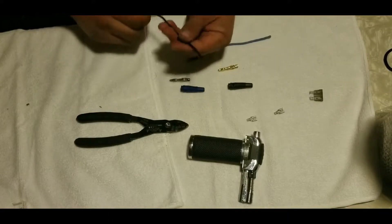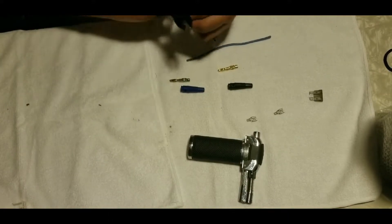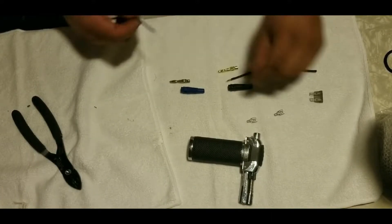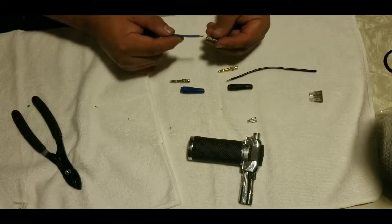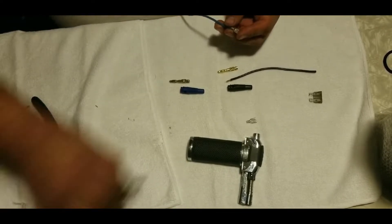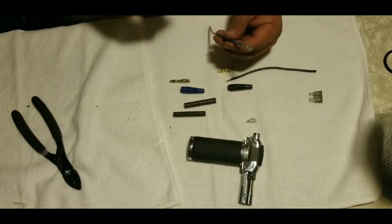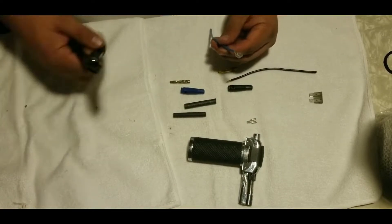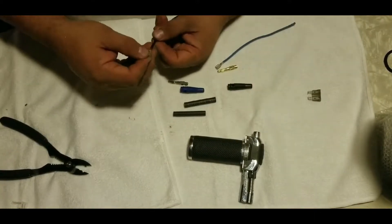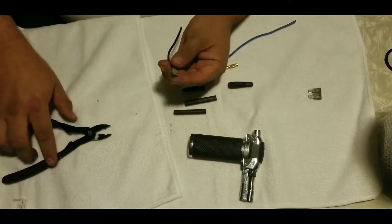It's going to be testing equipment, so you start off by stripping your wire. I'm going to install my spade connectors first — the order doesn't matter as long as you get them on there. I crimp them on, and then you want two of these — spade connector on one side, banana jack or just the wire on the other.